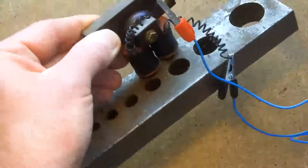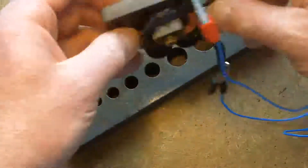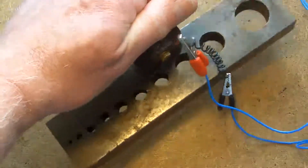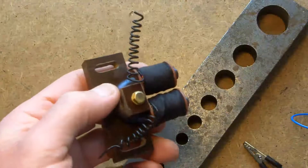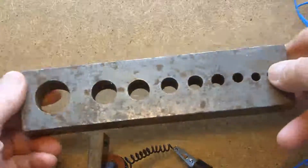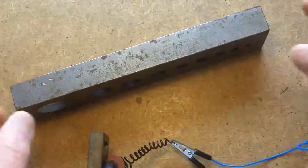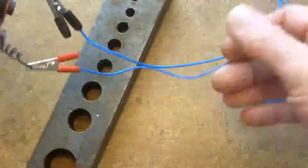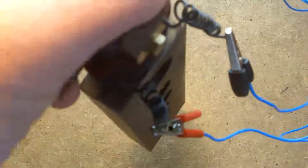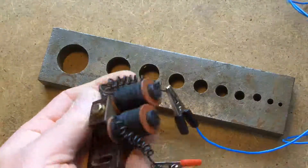Just give it a bit of energy — that's a fairly lumpy block of metal. That was showing off a bit because I put 30 volts on it, but even at 3 volts it's quite powerful. This block of metal weighs something over two and a half pounds — I just put it on the kitchen scales but they only go up to two and a half pounds and it's over that. So just put 3 volts on here, and that's that block of metal being lifted. Switch the power off. So that's what I'm planning to use to move my little pendulum.